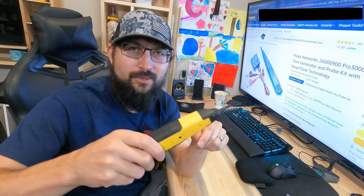A lot of people make the mistake of just turning this thing on. Even the instructions don't explain this very well — this is just from years and hours of troubleshooting and using tone generators. It really takes experience to know the best way to use these. I actually found a wire where whoever pulled it didn't make it all the way into the switch box. It was halfway inside the conduit — carflex — coming down towards a switch for a pergola, and I actually found the missing switch leg that didn't make it all the way down to the switch box.